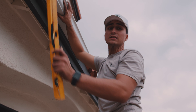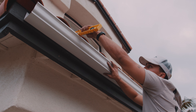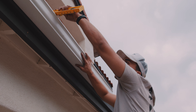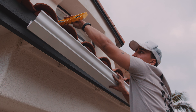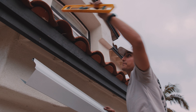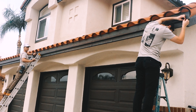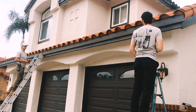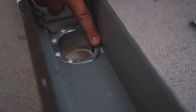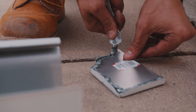To know exactly where to put the gutter, you can take a level and set it on the lowest part of the roof. If you have a flat roof, it's just going to be the flat part. You want the gutter to sit underneath this line because this is like pretending the roof continues off. I'll mark this so it'll be a nice little descend down to this side where the downspout will be. I'm going to cut that out before we install it because we don't want to attach anything while we're up there. This will help keep it waterproofed and stick better so it won't come apart.